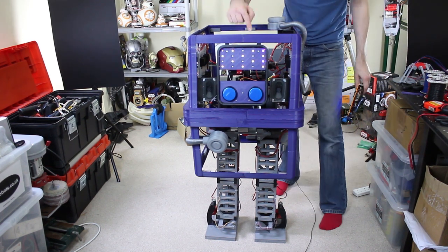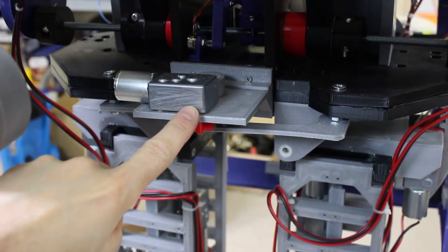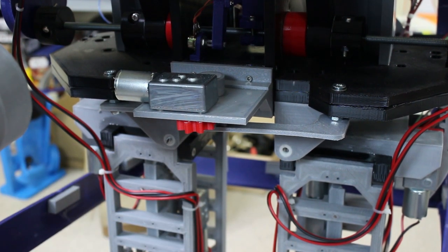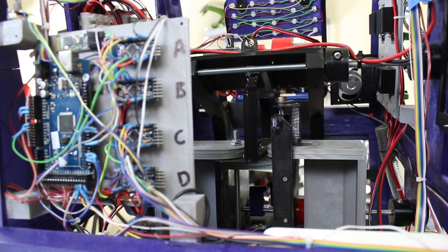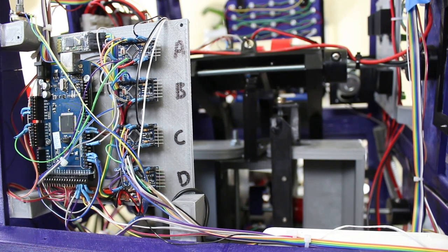So now we can wire in that motor to split the legs open and hopefully we can make it turn on the spot. There's that motor we need to wire into some sort of motor driver, and there's a pot at the back that measures as the legs rotate. We're going to use the main control mega to read that pot and drive the motor at the right time in the loop, because if the legs split with whichever foot is on the ground it'll have the opposite effect of pushing it left or right.